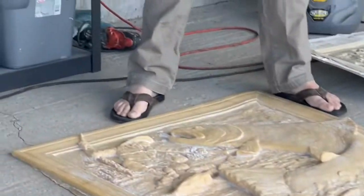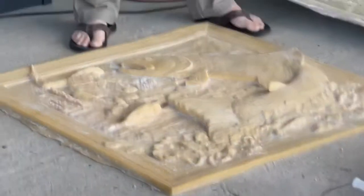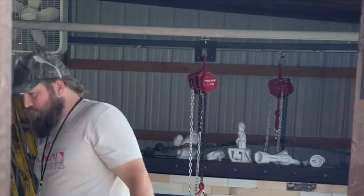If you're trying to pull that out it's going to break if it's a hard pattern. But since there's enough flex in these urethane patterns, he can get away with quite a bit of undercuts, as you can tell in the piece he cast last night. When you're working you've got to think about how you're going to get it cast — sometimes sand molding is a cheaper option.